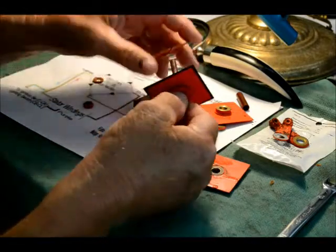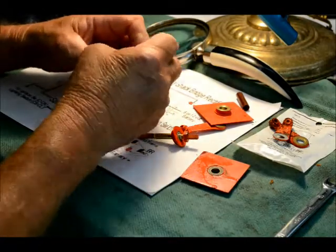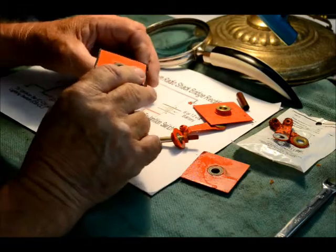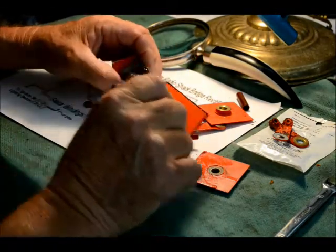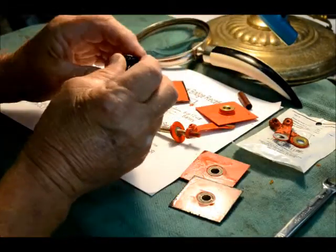I have to use a smaller bolt — that's obvious. Once we get it together, I want this to sit between these plates and use one of them as a heat sink. I think it should be plenty. From the outside you'll never tell it's been replaced by a modern diode.